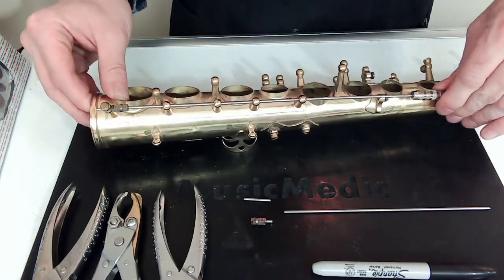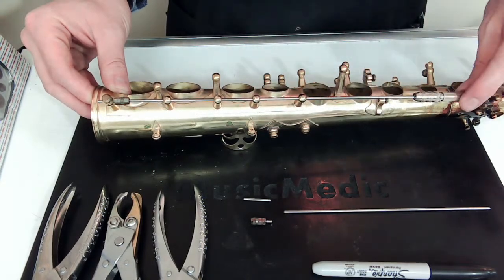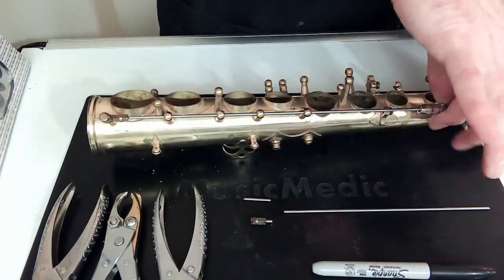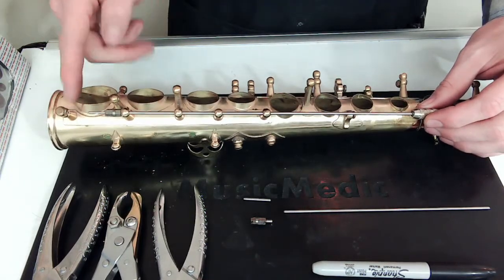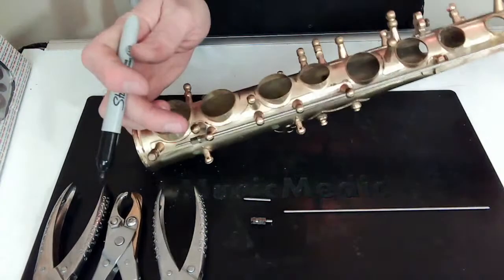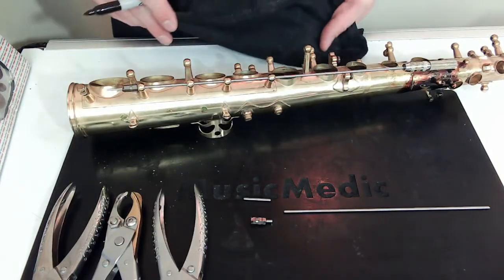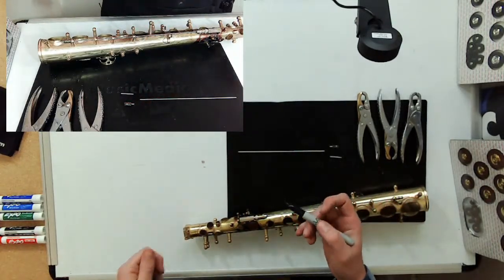Just a light push — you can see I'm just pushing with my finger over here as I give it a couple of turns. What you'll see is a nice clean faced surface. If you have trouble seeing it, you can use a Sharpie — bonus tip: cover the face of the post with Sharpie marks. That gives you a clear visual representation of how much you've taken off and whether or not it's actually been faced.